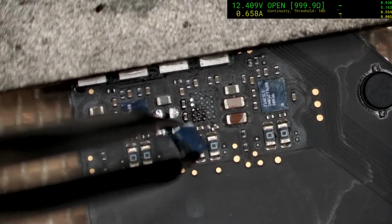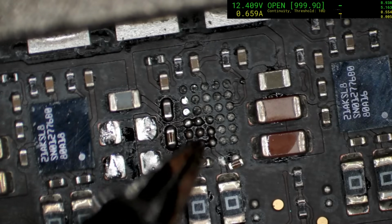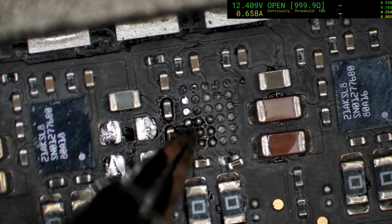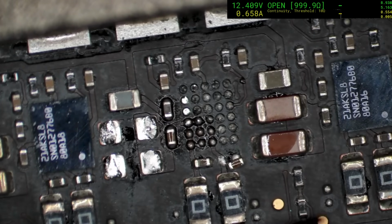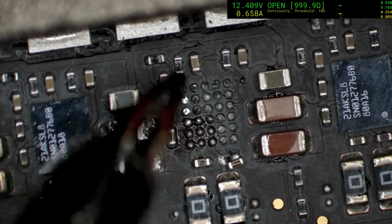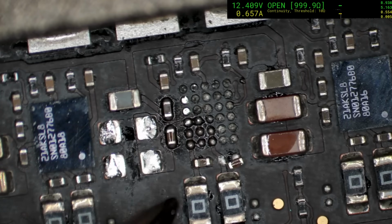We can see that corner area is somewhat browner and different. So this here is the area where the corrosion came in. We saw the dots of corrosion on the caps here, and then there was corrosion under here. Now, that corrosion could have come from a multitude of things. There could have been a speck of trash that came in. We did see that there was dust and things like that in the case. So it could have been a speck of trash, or it could have been a bug, but I'm thinking this one was more of a speck of trash that came through.